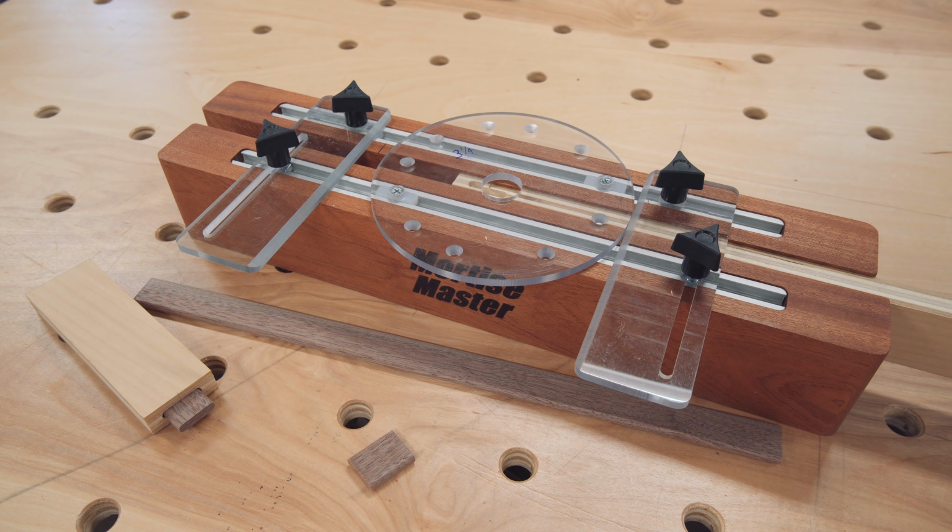And this is actually really easy. This particular plate that comes with the jig is 6.5 inches in diameter. Half of that is 3 1/4 inch. As you can see, I wrote it right there. So 3 1/4 inch from either side. Just to save a little bit of setup time, I've gone from the center line, marked 3 1/4 inch, and put a line 3 1/4 inch over here and struck a line. So that's the plate itself.